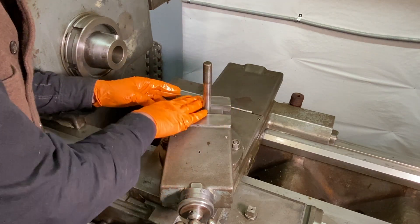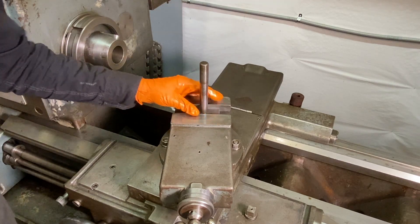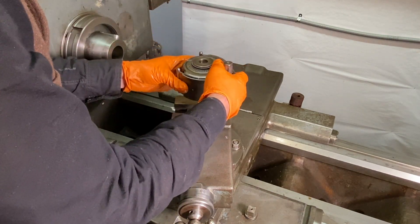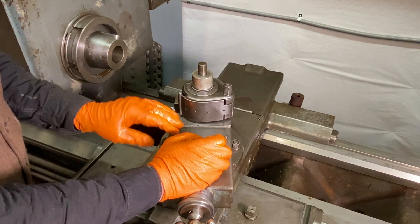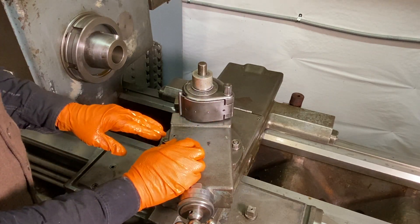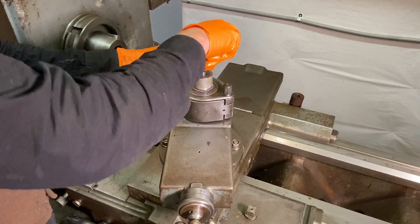I might do the same thing — I think it would be great to have a nice T-nut in there that came all the way up and a nice surface for this tool post to mount on. I'll slide the post in there and drop this down right over the top. I'm planning to take apart this compound, redo the gibs and get it all tuned up. When I do that and machine a T-nut, I'll put a shorter post in so it isn't sticking up so high.